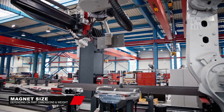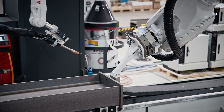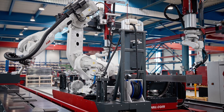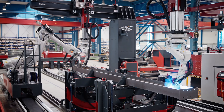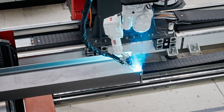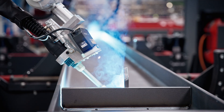After having determined all parts are compliant with the 3D construction design, the process of tack welding can now start. Depending on the weight and size of the parts, the handling robot automatically selects the suited magnetic gripping tool and places the part in its defined location, allowing perfect positioning 24/7, all the time, all day long.